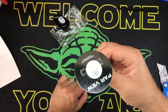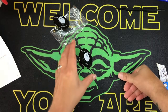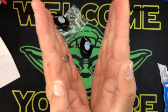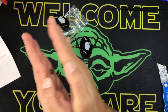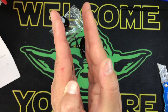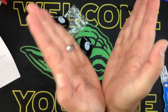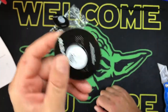It's kind of scuzzy out today but I'm going to do a range test. With patch antennas, the bandwidth or decibels work like this: the greater the decibel - say a 20 decibel antenna - this is your spread, so you better be staring right at that quad. A three decibel isn't as powerful but you have a wider spectrum. A 20 decibel antenna will go like two miles but you better be looking right at it, whereas five decibel is much wider but less throughput.